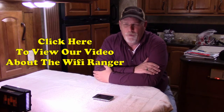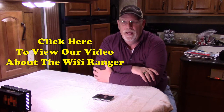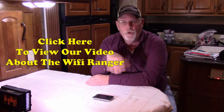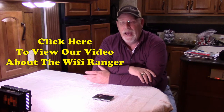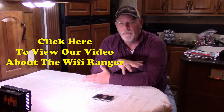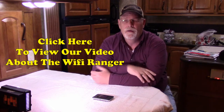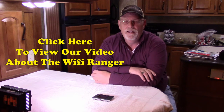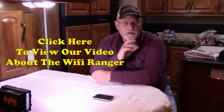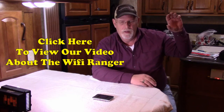Now, what the Wifi Ranger does is it's a system we have in the RV that has a router, and we use that router for the internal use of our RV, meaning that this router, we've given its own network name, and so all of our computers, all of our cell phones, even our wireless printer is tied into that network. And that network also is tied into an antenna system on the roof and also an internal extender unit, which is called just Go, and another one's called the Elite.